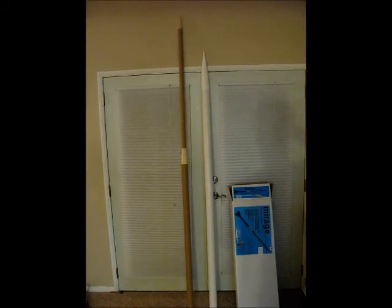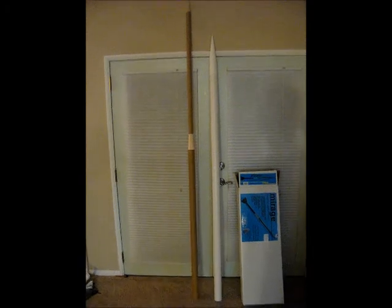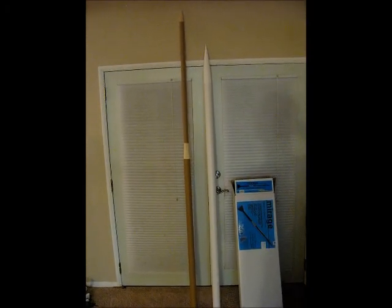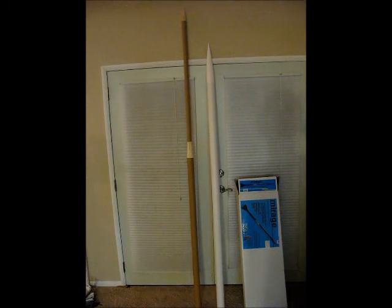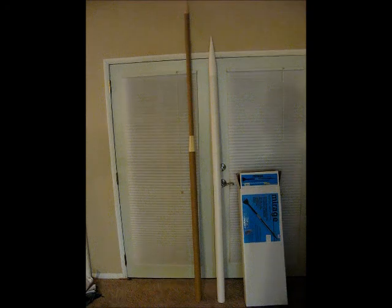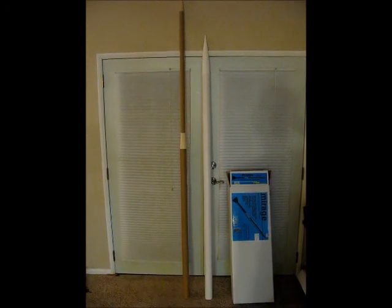And anyway, the next step, what I'm going to do is actually try to fill in all the little spiral lines on the tubing with some good old drywall putty that I can mix up and dries quick. And then I'll sand it all down and glue the transition to the top piece, glue the cone in. It's actually going to pop off in the middle when we do an ejection, so I'll show you after I get that all squared away.